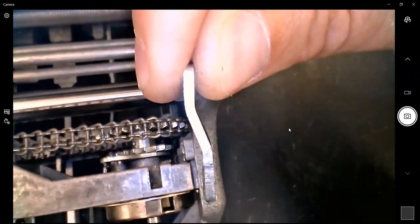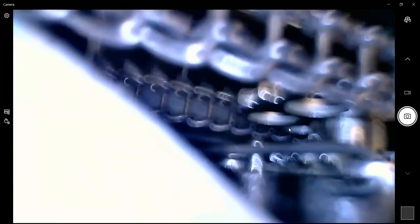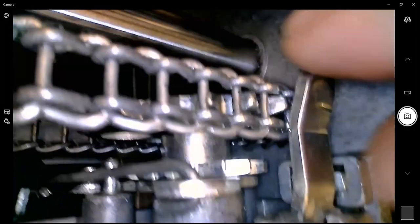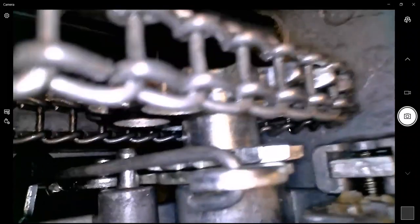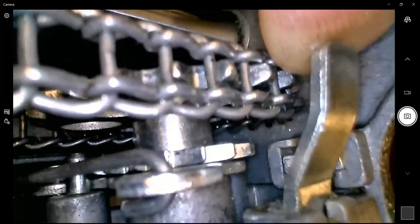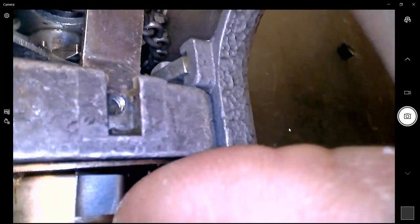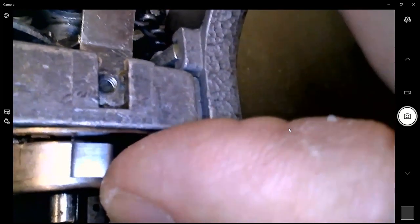This isn't a straight piece — there's a kind of a bend. If put in the wrong way, that bend goes downward and will rub against the screw when you put the plate back on. The nut hole goes toward the front of the brailler, and if I put the fat part of my finger in there, I can get a good eighth of an inch of play — that's a good thing. Just be mindful when putting the front plate back on. You may need to reach around and put your finger in there to hold the chain check while you tighten the screw down on the front plate.